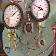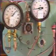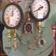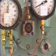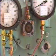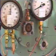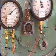We'll see a similar phenomenon, but not quite as severe. Again, there's no foam in the crankcase sight glass. The oil pump is just starting to bubble and starting to lose its prime. The oil pressure is so low that we would have tripped an oil safety switch if there was one, and we're continuing to feed mostly gas into the oil pump. The compressor is on the edge of a failure condition — it may or may not fail. The pulsations may mean there are little pulses of oil going down the crankshaft. Suction is at zero, not in a hard vacuum. When the valve is opened, it recovers and stabilizes very rapidly.